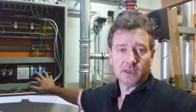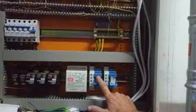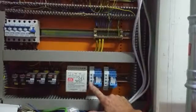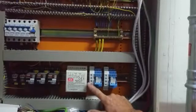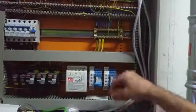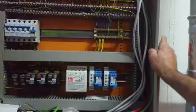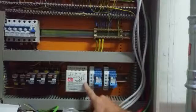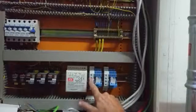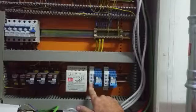What we're going to do is use these two relays to control each system. Here we have our two relays and our two timers. These timers can be controlled from zero to 30 hours. We have a 24-volt transformer for our control lines — one stretches about 60 meters, the other is about 20 meters. So we use 24-volt DC to get that distance for our control relays and timers. These will run on 230 volts AC or 24 volts DC — very handy.